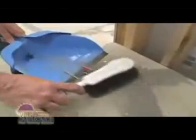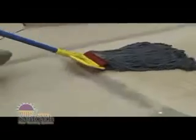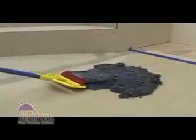Now you need a clean surface to install the mat. Make sure there are no objects on the floor or fasteners penetrating the floor that might damage the blue heating wire. Carefully sweep the floor, or better yet, use an industrial vacuum and clean the floor thoroughly. Then, damp mop the surface to remove as much dust and debris as possible.